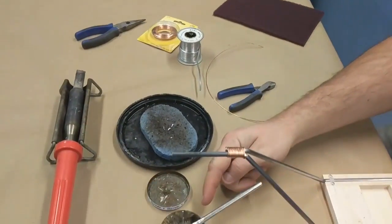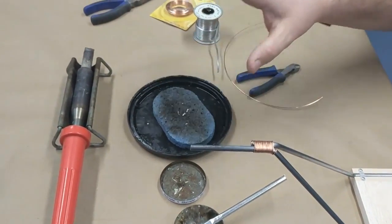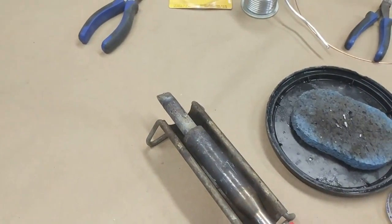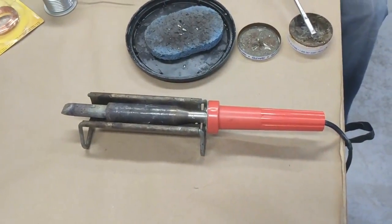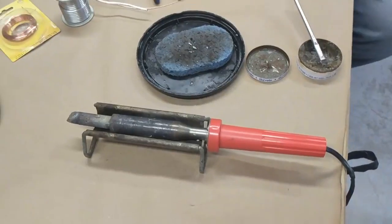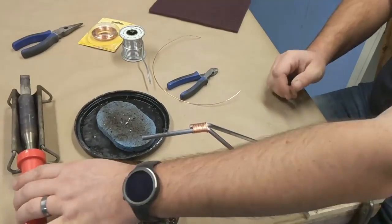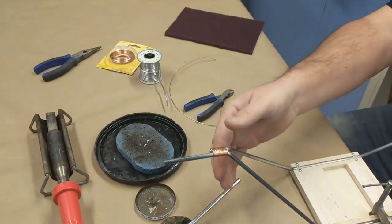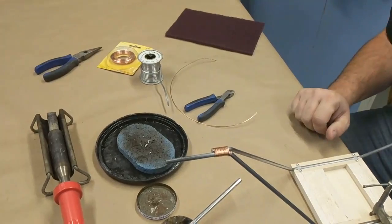You want a good flux, a wet sponge for cleaning off the tip of your iron, and the iron is the key thing. You need a decent sized, big iron. This is a 175 watt iron — you can get them for around $55. The advantage of the 175 watt iron is you get a big 5/8 inch chisel tip, and that's going to hold the heat and transfer it into the wire so it melts properly. Otherwise you'll end up with cold solder joints.